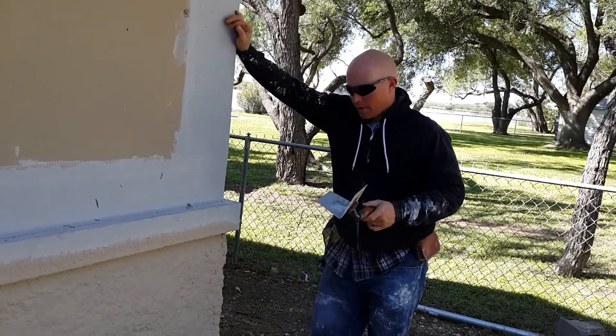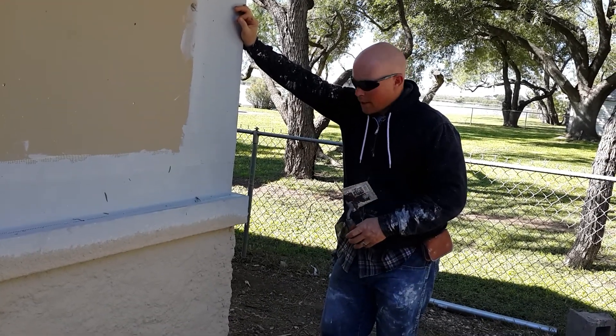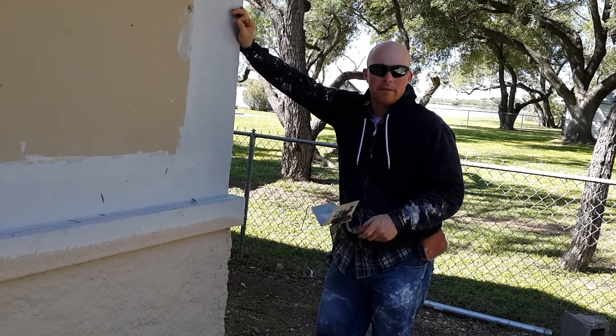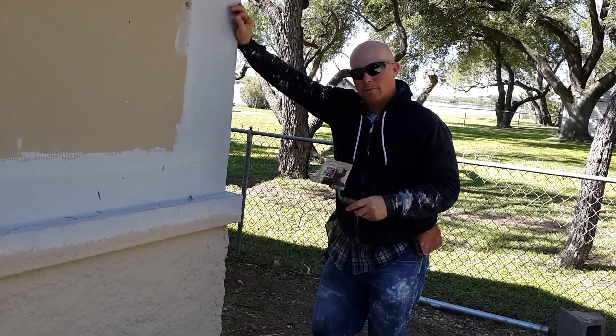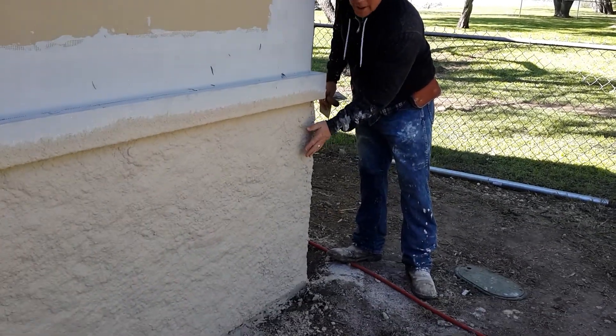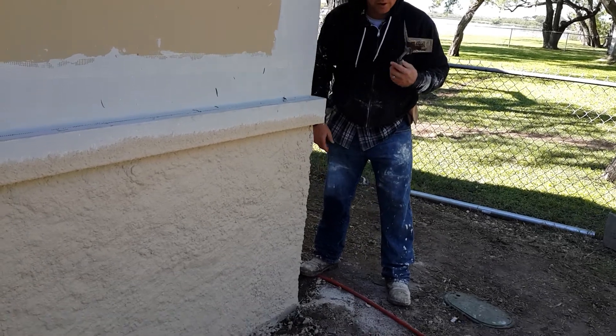Here's what you do. When you blow your stone on, as you're blowing the whole thing on, don't even worry about the corners. Come back to it probably 10, 15, 20 minutes later — probably not an hour later, but 20 minutes later, when it's nice and pliable but it's not going to fall off the wall. Come to it, start at the bottom, and pull up. That's all you've got to do.